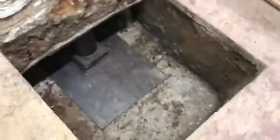And what we did on Saturday, we did our first pour of high-strength concrete. This is 3 feet of 100% cement reinforced with fiber mesh. Once that's cured, it brought us just enough to get our pier and plate and everything underneath the bottom layer of stone. And then here, just within the last couple hours, we just got everything raised up.